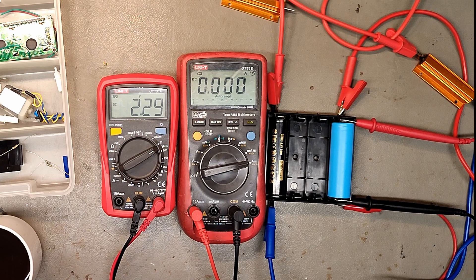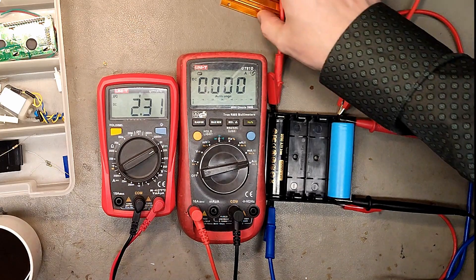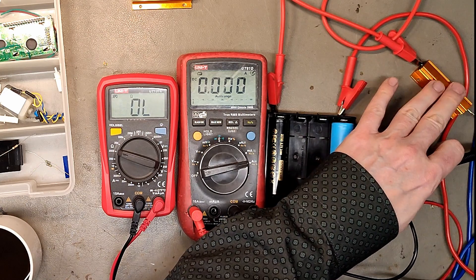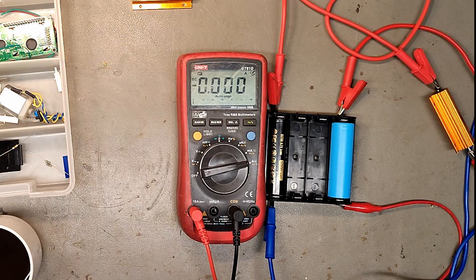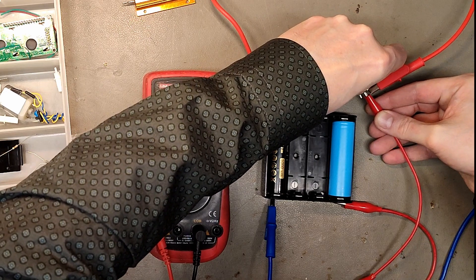A really low value resistor, but I think it's going a little bit too slow. This is super safe but we're gonna try. This was the 120 ohm — it actually works, it takes a little time but it's worth it. I would probably go with an even lower value. It was 50 ohm, so maybe in the 10 to 20 ohm range. I will redo this so it doesn't have as many wires. I will test the potentiometer though.